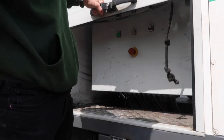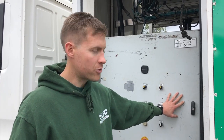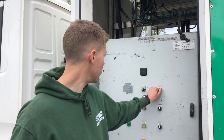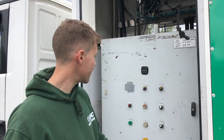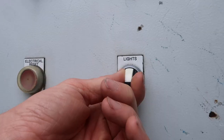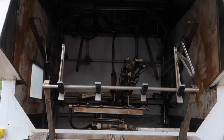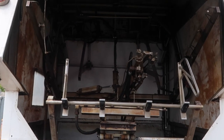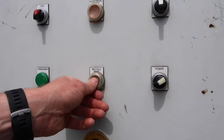In here is the main control panel. You've got the external switch for the external wash in the chamber — that's if you want to wash the outside of the bin as well during the wash cycle. You've got your recycler, which is the filter and pump system that recycles the water and pumps it back up to the main tank. You've got the electrical reset, which is a safety feature — every time you turn on the power you hit the electrical reset to start. You've also got the external lights. You've got the test mode — if you turn this and press a wash cycle, the back system will go through a wash cycle without squirting out any water so you can see how the robot is working and how it's moving from side to side. The recycle wash — when you press this button it will force some water through the recirculator to clean it.